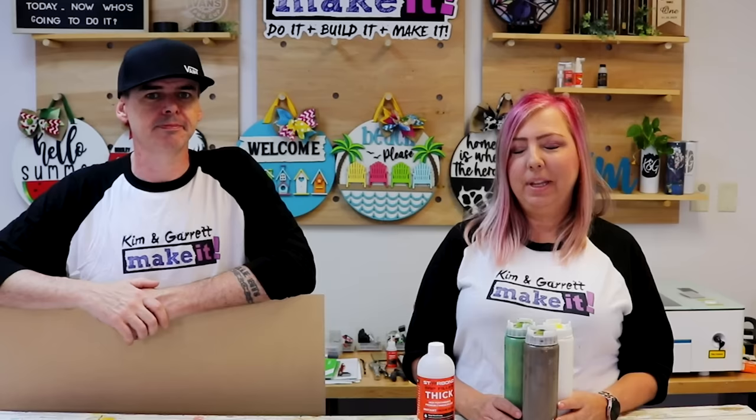And we're going to seal that MDF with this exterior house paint. We use exterior house paint because it has all of those additives in it that make it water resistant, mildew resistant, and UV resistant so that they don't fade.